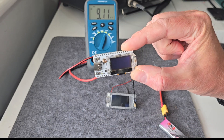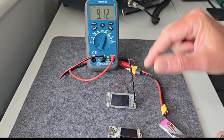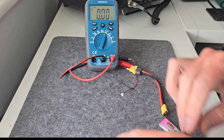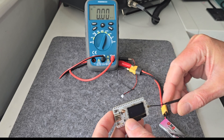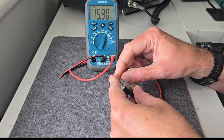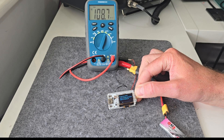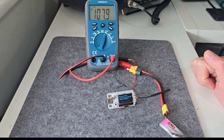Shall we compare it to the OG Heltec — the LoRa32 V3 — and see what the difference is? We're about 9 milliamps idle on the T114 with no Bluetooth. Now this V3 is on virtually the same firmware, because different firmware versions can bring power optimizations. Let's start it up — look at that, 43 milliamps going up to 108 as it's booting. So yeah, insanely different, and that's the difference between ESP32 and nRF52 — it's crazy really.